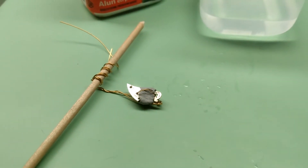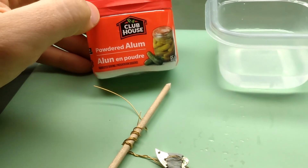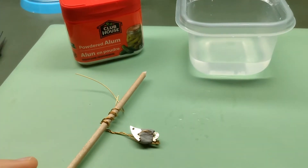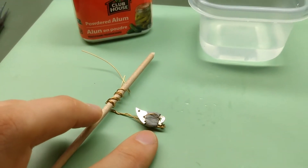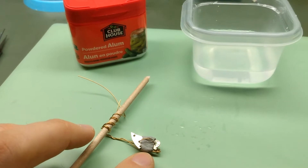So I found a very cheap scrap movement so I can get another screw. But I had to do something I've not done before, which is dissolving a screw in alum. This is alum powder — I bought mine on Amazon, and my understanding is you can find it at most grocery stores. It will corrode or eat away steel, but not the brass plates surrounding it.